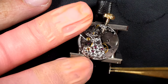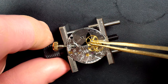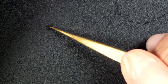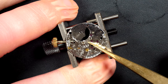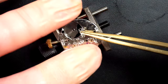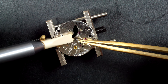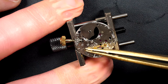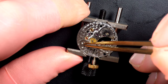One piece of advice: if you want to start watchmaking as a hobby and work on your home watches, I would not advise starting on women's watches, because they are so small. This caliber compared to a men's caliber is half the size or even smaller. Each part is harder to handle and harder to put back. Even though they are usually cheaper watches, I find it more difficult to work on a ladies' caliber because of the size. Try to avoid them at the beginning — once you're confident, you can move on to ladies' watches if you want.